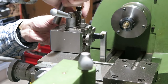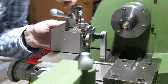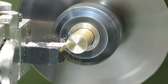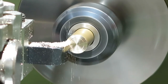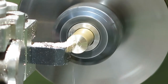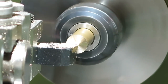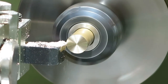Using that reference bar, and just running my fingernails between the reference bar and the tool, I'm setting the tool height to the same height as the reference bar. If that's been a success, I should be able to face this part and there shouldn't be a pip in the middle. All in all, I'd say pretty happy with that — and it seems very repeatable.